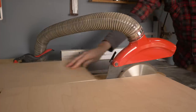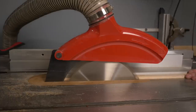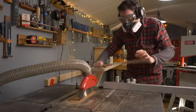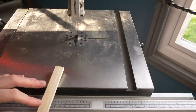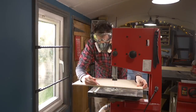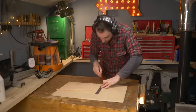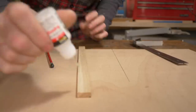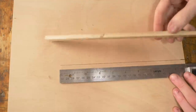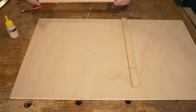First I'm going to cut down some 9mm ply to use as the base. I want the jig to run in the mitre slot so I shave down some wood so it's going to fit into it and then I can get it cut to length. I get the ply put on the bandsaw and mark out where the centre of the mitre slot is. I get some CA glue put onto the runner I've made and get it glued onto the bottom of the sled. I also glue another scrap of wood to the front of the sled and this is going to act as a stop.